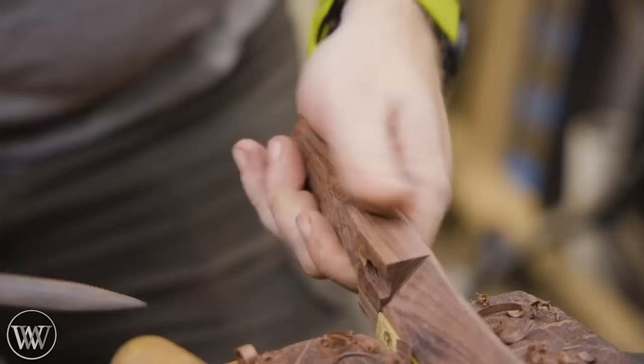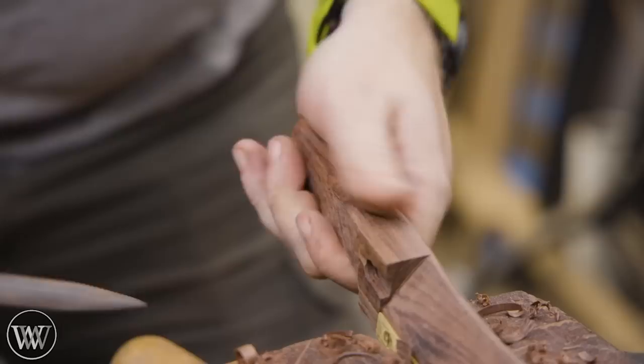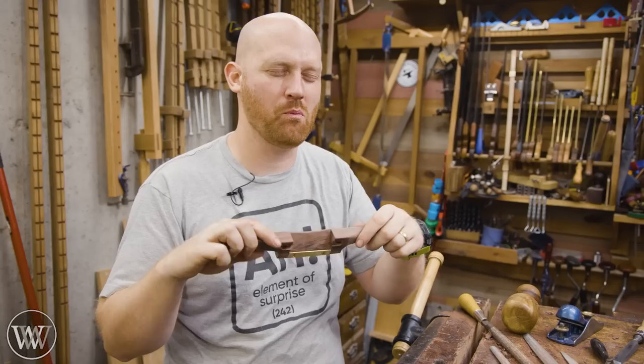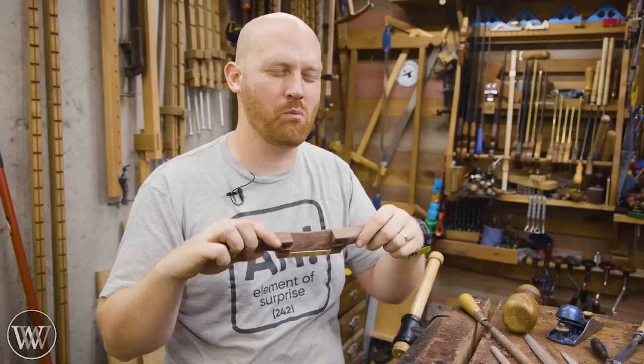For the ends of these, rather than rounding them off, I'm putting a very heavy chamfer right on the end and shaping that to just look and feel good. I like having a hard, chamfered look. But anywhere I can, I want to smooth it out. I'm going to be feeling it all over, make sure there's no rough spots — rub it for a while, go at it with a file, rub it again. It's amazing what you can feel that you can't see.